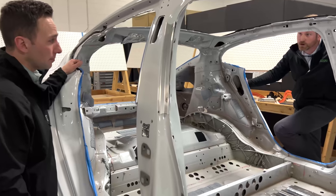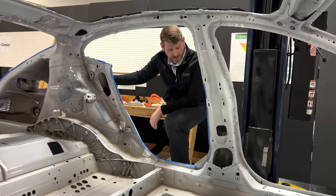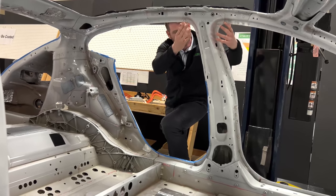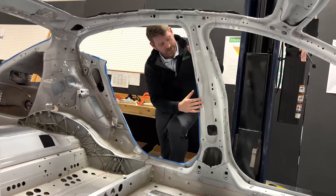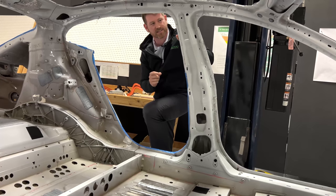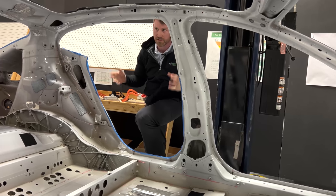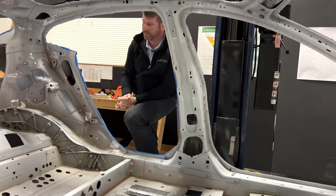You either get efficiency and pay the extra money in the technical price of the part, or — as many of the Pacific OEMs do — stitch together pillars with numerous separate panels. This handoff bracket might be a separate panel, the B pillar one whole panel of maybe a millimeter and a half thick, with separate panels above and below stitched together for the varied thickness they need. They view some aspects of capital investment differently than the big three here. We like big tools, big stampings, simple low part count, and amortizing that tool to get a lot of life out of it.